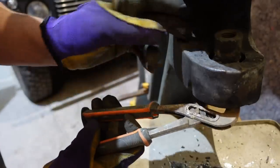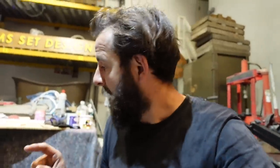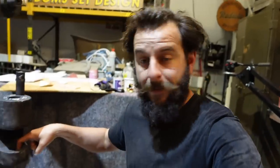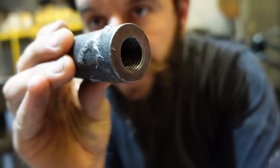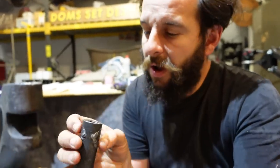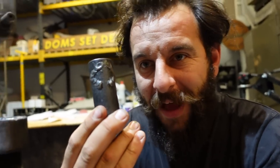Wow, oh my God. That was dramatic, wasn't it? My goodness, look at this - it's out. That's the first piece. There is no going back now. First bit has been removed. I have learned two things by doing this: what the inside of the casting looks like in there - it's not just a straight hole - which is really, really interesting and essential. I'm so glad I did it now because when it comes to casting the new ones I can make sure the inside is exactly the same as these beautiful old originals. So this is essentially the nut - as you wind the bottom wheel up to adjust it, this is the nut that it's turning in. What is stopping that from spinning in the lead? It's just a smooth piece of metal on top. Look what it is - I love how simple that is. It's just brilliant.